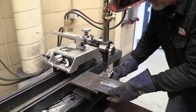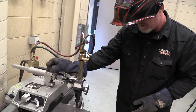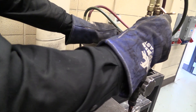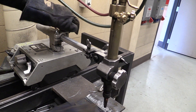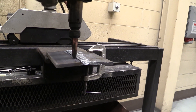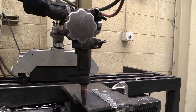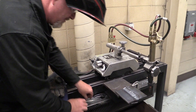So I'm going to set it up on the line burner. Make sure my clamp's out of the way. I'm going to come over to the other side and make sure we're set up and the angle is good. I'm looking at my nozzle — it's right about zero. Now being as the weld is the highest part, we've got to make sure we don't set it too low. We need to bring this a little bit above the weld so that's the highest part. I'm going to cut the end off and measure over an inch and a half, cut a strip, cut another strip, and cut another strip — just going to mark these out real quick.